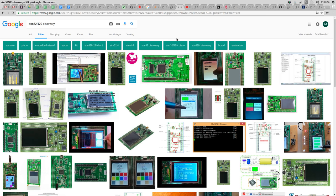Hello, in this video I'm going to be configuring and installing Linux on an STM32F429 discovery board. This board has an STM32F429 chip along with an 8 megabyte RAM chip. We really need that RAM chip in order to run Linux, because we're going to be configuring Linux to both run from Flash and then I'm going to show you how to make it run from the actual RAM on the board.